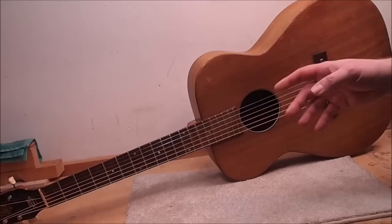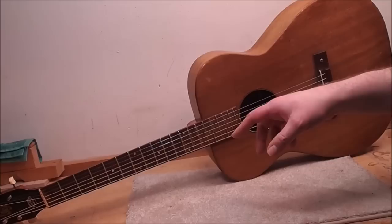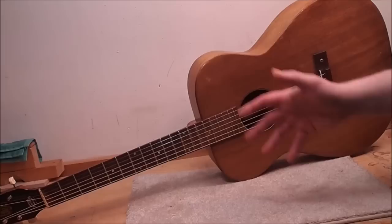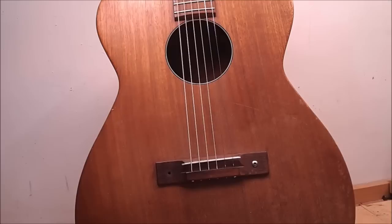It's not always the case with Gibsons — you can find all kinds of weird stuff in the neck pocket of a 1960s Gibson. People also ask about doing this on 1970s Japanese guitars: that's a whole other can of worms. They can have dowels in the neck joint, lots of glue, and different kinds that don't come apart easily. These Harmonies are available online for three, four, or five hundred dollars, and if you completely blow the neck removal, worst case you convert it to a bolt-on — nobody's going to scream at you the way they would if you did that to a 1961 Martin.